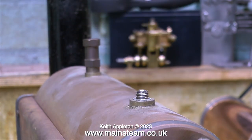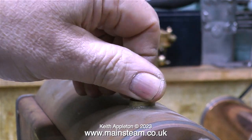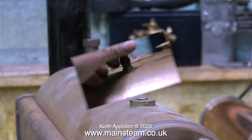Stuart Models have always had a very odd arrangement for taps, and I suppose it's quite clever. This is a stainless steel insert. What you've got to be careful of is not screwing it too far into the boiler bush, but then again it's not very tight so it comes out.